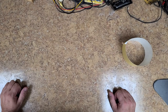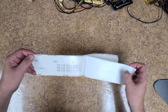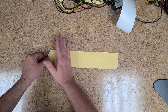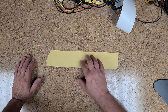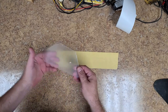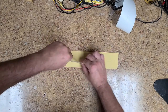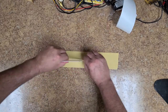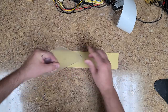I want to start rounding off the edges of the new panel I just made. I have some 320 grit peel-and-stick sandpaper. I'm going to lay it down on top of the counter, making sure there's nothing underneath that's going to cause a bump in the sandpaper, because a little bump or debris could throw you off from making nice round curves. I'm going to start sanding and rounding off what I see here - sanding until the black marker line is gone.